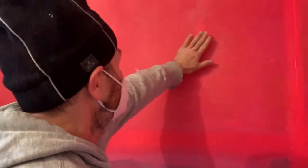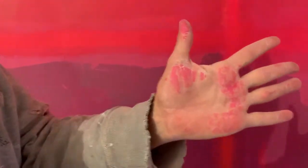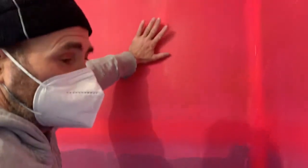This side is a little bit wet, but look at this. This is already dry. And this is still a little bit wet, see? Down here is still a little bit wet. But the part that I did up here, I can already touch. So very much you do it, you go and drink a coffee, or I can come back and install your tile. If you see a spot that you think needs a little bit more, do a little bit more. This is Redgard, very good stuff.